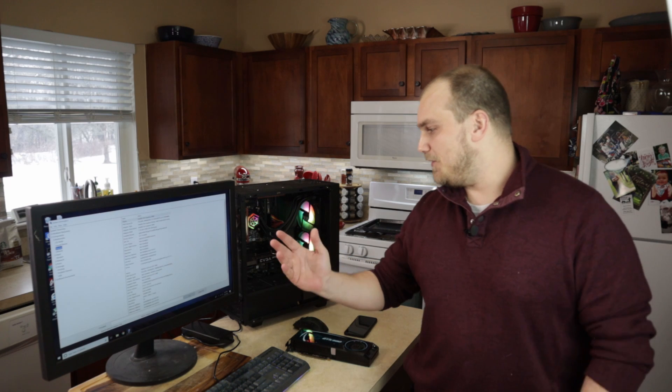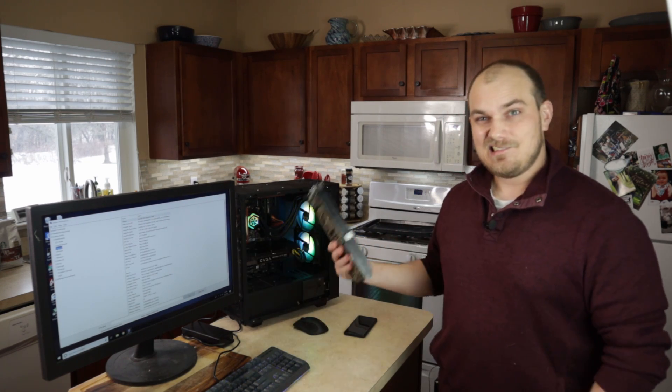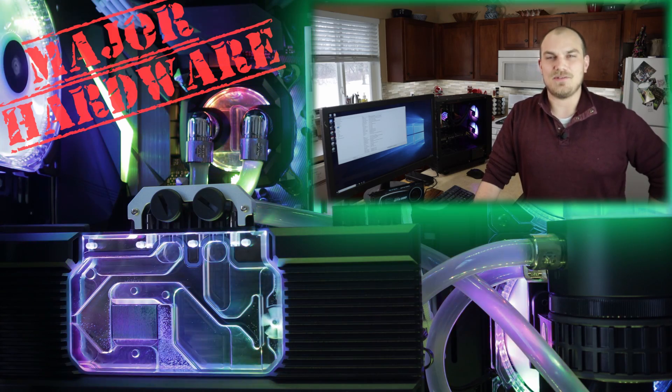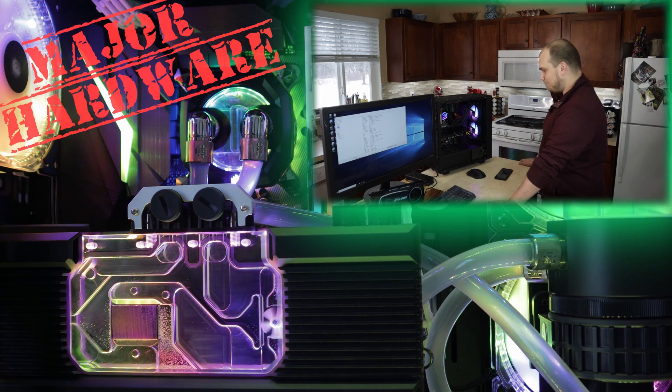I don't even know what a used GTX 1080 goes for — 300, 350. But either way, there you go. If you want to give it a shot, it does work. What I did: oven at 375, obviously take your old cooler off, all the thermal paste off, clean everything up, try to get some of the dust off — oven 375, 10 minutes. Put the card's PCB on some tinfoil balls to get it off the cookie sheet. Wait 10 minutes, take it out of the oven, let sit for 30, put it back together and cross your fingers. As you can see, didn't fix the 580, but it did fix my 1080. Thank you guys for watching. Thanks for the idea — I've never really heard about doing this before. I'm glad you guys recommended it, I'm glad I tried it. And wow — just wow. See you next time.